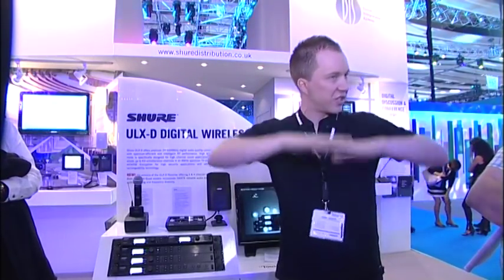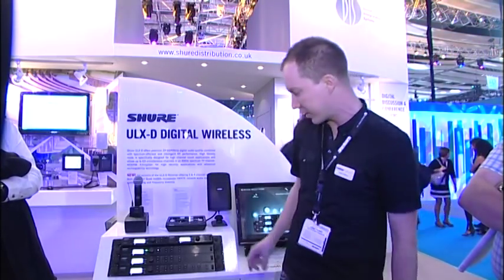There's a great video at Shure headquarters where we put 100 channels into literally 12.5 MHz. Again, this is due to the digital nature of what we're sending, but also the lack of intermods. The intermods are still there — it's physics — but they're so far down in the noise floor that you're not worried about them, and that's not what you're recovering.